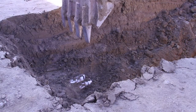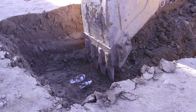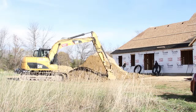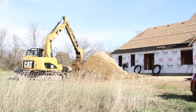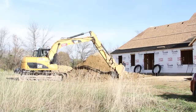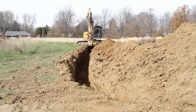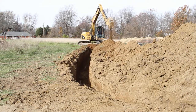From that point on, the trench for the loop is dug by the excavator. The trench is dug away from the home with a minimum distance of 10 feet from utility lines, foundations, and property lines. Counties may have specific code that differs from these standards. Trenches can be curved and turned corners, but each trench must be a minimum of 8 to 10 feet apart from each other.